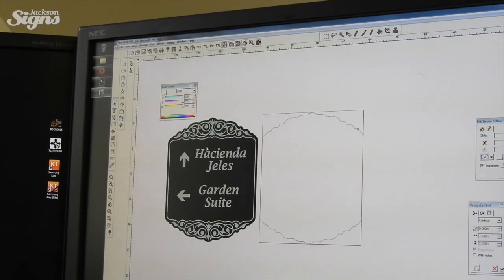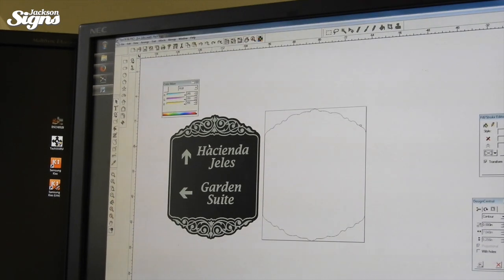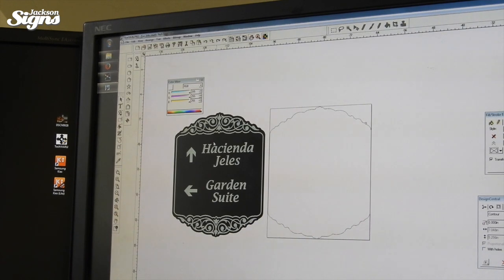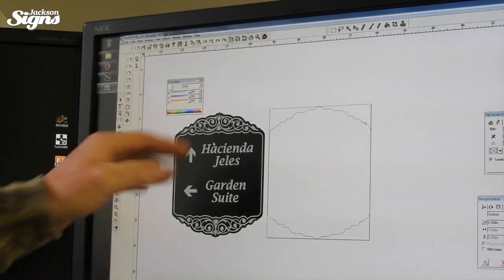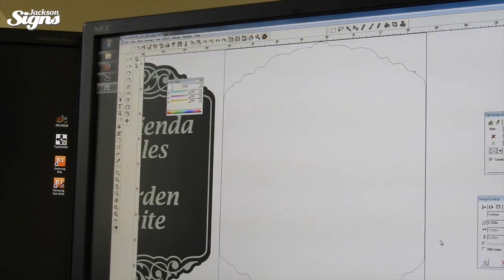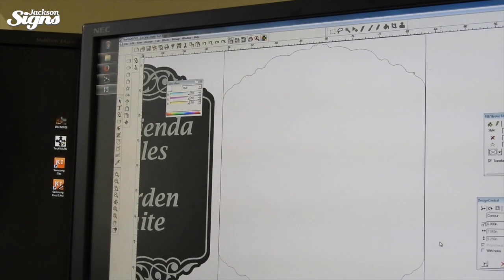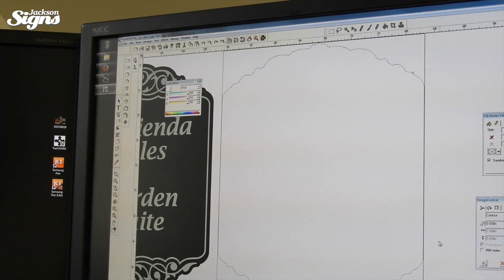What I'm working on today is a wood or sandblasted HDU router and sandblasted sign. This can also be used on wood, or this is how they make monuments for gravestones, marble, or things like that. This design is for a person's house and guest house — I'm pretty sure it'll be two shades of brown. First, I'm going to create a stencil with just a cut line, lay it on the HDU, and trace around it before cutting with the saw. These I pretty much make all by hand using hand tools. The next step is laying the stencil onto the HDU — high-density urethane substrate.